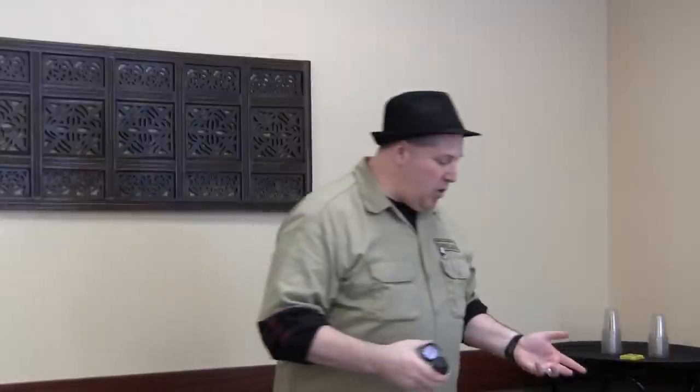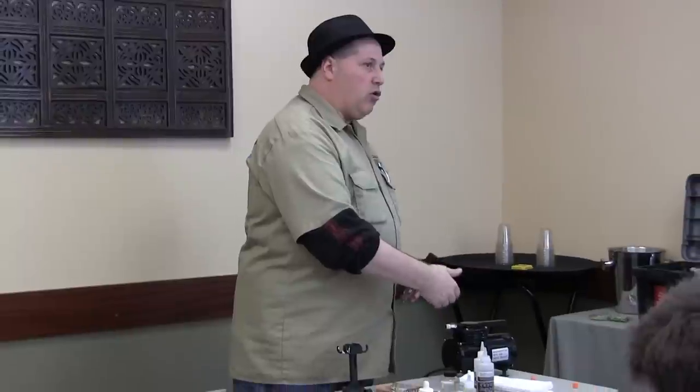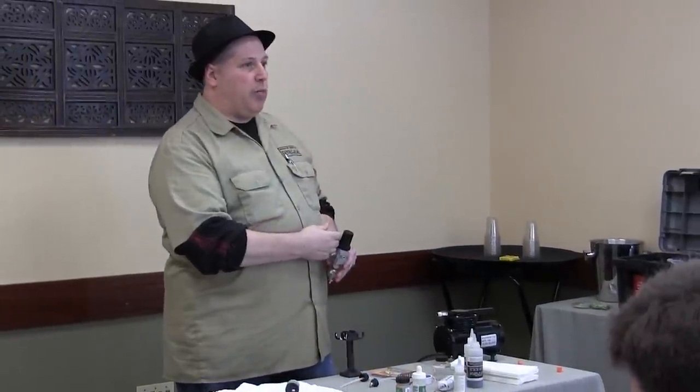Now, one thing that I usually advise people is that if at all possible, get the moisture trap a little bit away from your compressor. Get some copper tubing at the Home Depot or the Lowe's or the Menards or Ace. I don't think I mentioned Ace before. And try to get it a little bit away from your compressor so that the air is going to cool before it gets to the moisture trap.